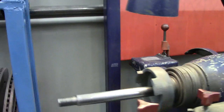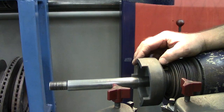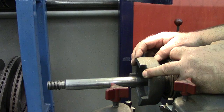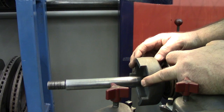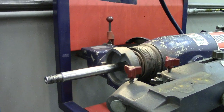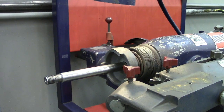And when I say pushed back, watch the amount of wobble that actually happens in this because it is loose on the hub. And you can see that going on. So again, it's going to be pressure pushing back on this that literally is going to flatten this unit out on there. So we've got that adapter. Now we're going to go with a conventional setup on putting our centering device in. It's going to be done a couple of ways and I'll show them to you.